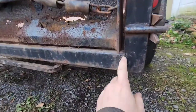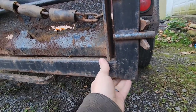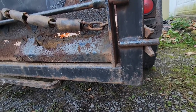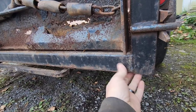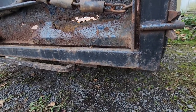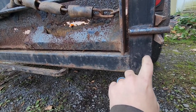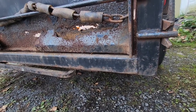So today I'm going to come in here and notch this out and replace this bottom beam. This is still pretty good solid metal — it's just the bottom, actually just that corner really. This side's still in pretty good shape. So I'll take the angle grinder and cut-off wheel and cut through here, and I'm going to leave that so I can cap off the new piece.